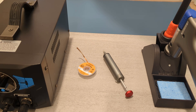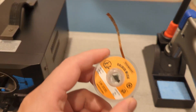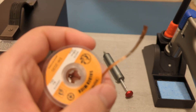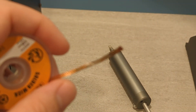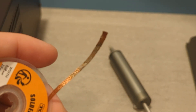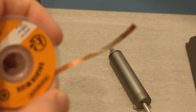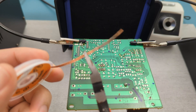Let's remove a component using a solder wick. A solder wick is basically a braided copper wire coated with flux. The flux is what makes solder flow and get absorbed by the copper braid. Always use a fresh piece of solder wick — if it's already used, it won't absorb much solder because the flux is gone. Just cut off the used part with a wire cutter and you're good to go.